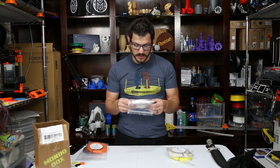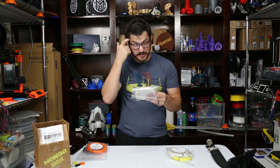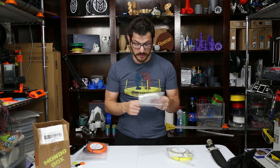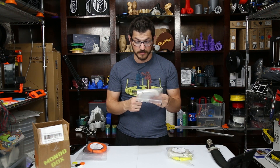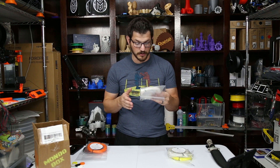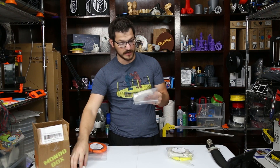We have IC3D Industries White PLA. Compatible with nearly all FFF 3D printers, IC3D filament is extensively tested using various extruder designs and hot-end styles. Made in the USA. Print settings 50 to 100 mm/s, extruder temp 200 to 240 — a little bit higher than the Hatchbox and the 3D Mars. Bed temperature 0 to 60°C, non-abrasive. And this is an extremely white filament, so that's very nice to see.